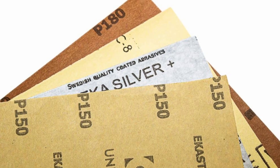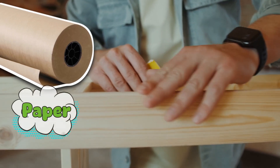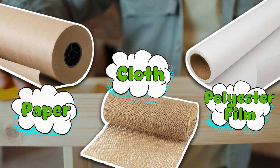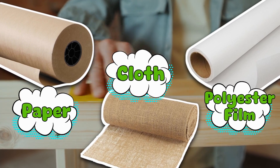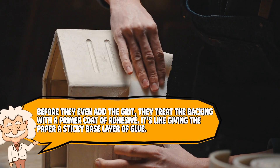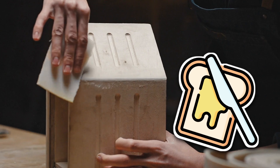Now that we know what the sand actually is, let's look at what holds this whole thing together: the backing. And no, it's not just flimsy notebook paper. Manufacturers use three main types of backing — plain paper, cloth, or a polyester film. Each has its own vibe. Paper-backed sandpaper is the everyday version: cheap, flexible, and great for quick jobs. Cloth-backed is the heavy-duty kind that can bend around corners without ripping. Polyester film is like the luxury sports car of backings — super smooth and precise for high-end work. Before they even add the grit, they treat the backing with a primer coat of adhesive. It's like giving the paper a sticky base layer of glue, basically prepping it for its rocky makeover. Imagine buttering toast before dumping on sprinkles — except instead of sprinkles, it's sharp shards of industrial crystal that can rip apart your thumbprint.